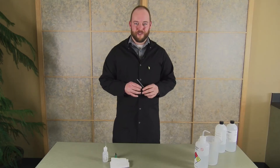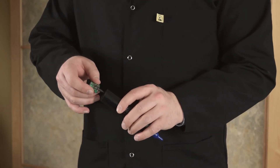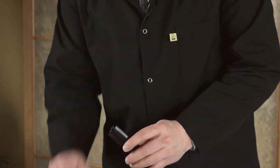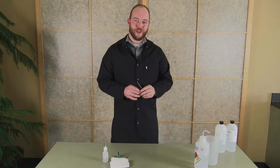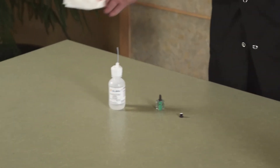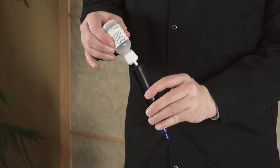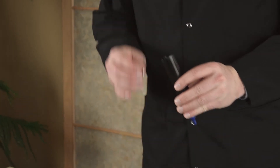When you get your sensor, you'll need to refill the reference fill solution. To do so, use a flat-headed screwdriver to remove the reference junction. Discard the solution — it contains silver so it shouldn't go down a drain. Instead, you can empty it on a paper towel and throw it away. Place the tube on the reference fill solution bottle in the bottom of the reservoir and fill slowly to avoid bubbles. Fill to the bottom of the threads and replace the reference junction.